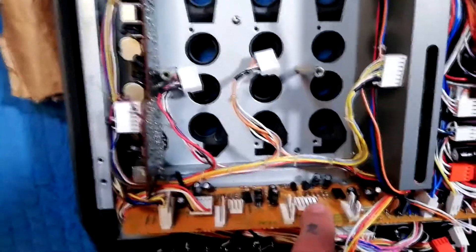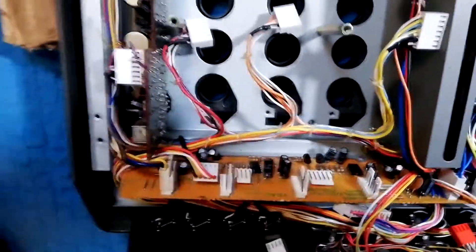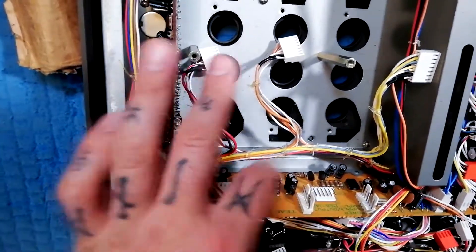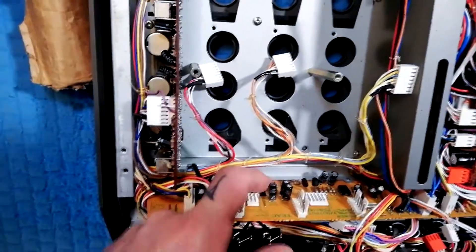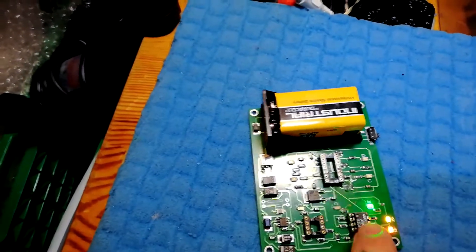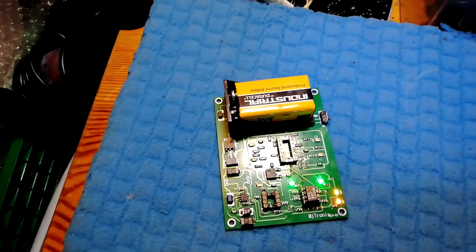At this point we can see this board more clearly — this is the master fader, this chip and this chip here. There are two op-amps in each chip; an op-amp typically has four pins: positive and negative DC, and then an input and an output. So these little eight-pin chips have got two op-amps in them each — this pair will be the left and right channel going into the fader, and this pair will be the left and right channel coming out. We thought this one's okay and it's probably this one that's faulty. I'll reflow all the contacts, then I'm going to remove this chip and use a primitive op-amp tester to see whether it picks up the fault. The tester seems to be saying that both operational amplifiers in this integrated circuit are working correctly.